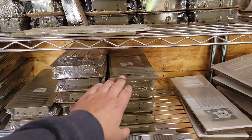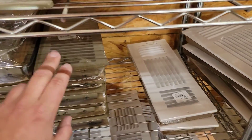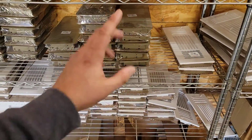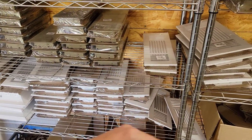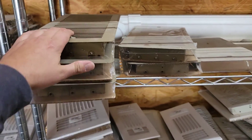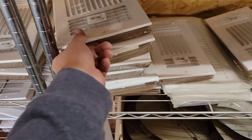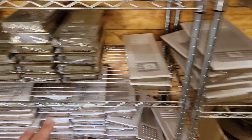Supply vents or floor registers — these are floor registers and these are ceiling registers. Floor registers mount in the floor inside your boots; ceiling registers mount in the ceiling for your supply vents. There are different sizes of boots: 4x10, 4x12, and 6x12. You can get a small 4x8 or a 6x12 depending on your needs.